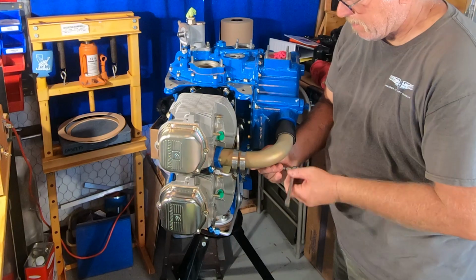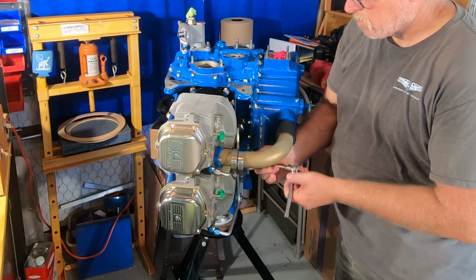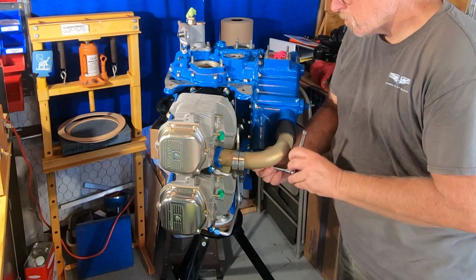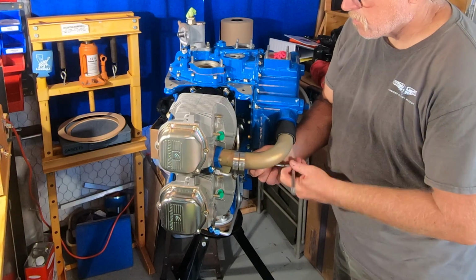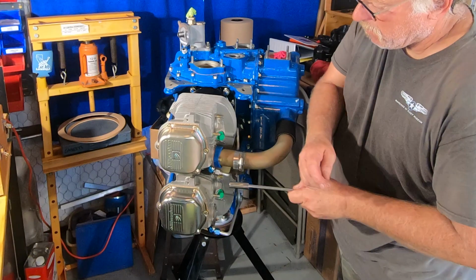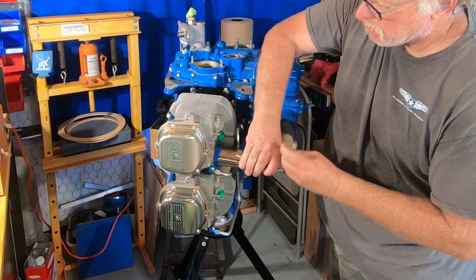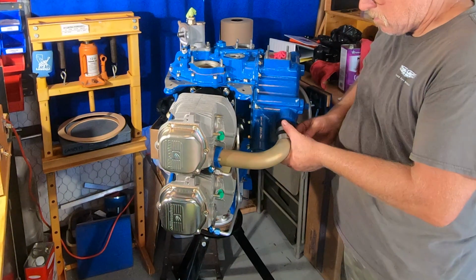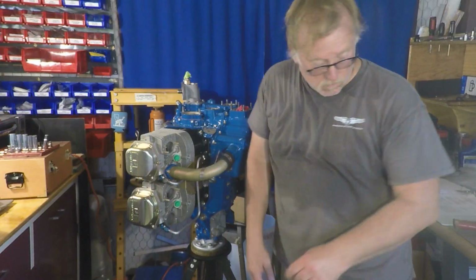Totally mechanical. It's nothing more than a mechanical coating. It has nothing to do with cosmetics. If you are getting any CAD plating done, there is variability in it. As you can see between those two products there is a variability of shading, and that's okay. It's not anything that you really control. You're not doing plating for cosmetics as far as cadmium plating. Chrome plating, sure, but not cadmium plating. It's purely mechanical corrosion protection.